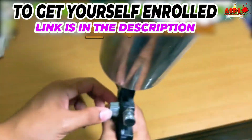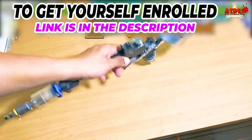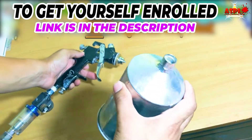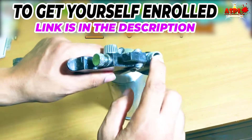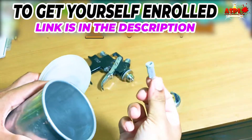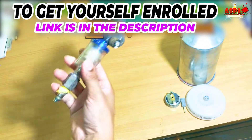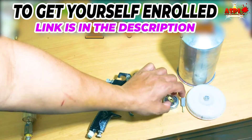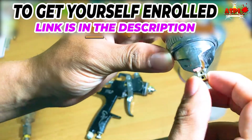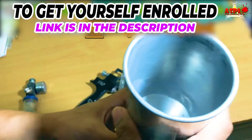The next knob is the fluid flow knob, which controls how much fluid comes out of your spray gun. To set the full fluid flow, first loosen the locking ring, then tighten the fluid flow knob. Press the trigger and then loosen the knob until the trigger can no longer press anymore — but keep the trigger pressed while doing this, otherwise the entire knob will come out. Once you reach that position, keep the trigger pressed and start tightening the knob again.